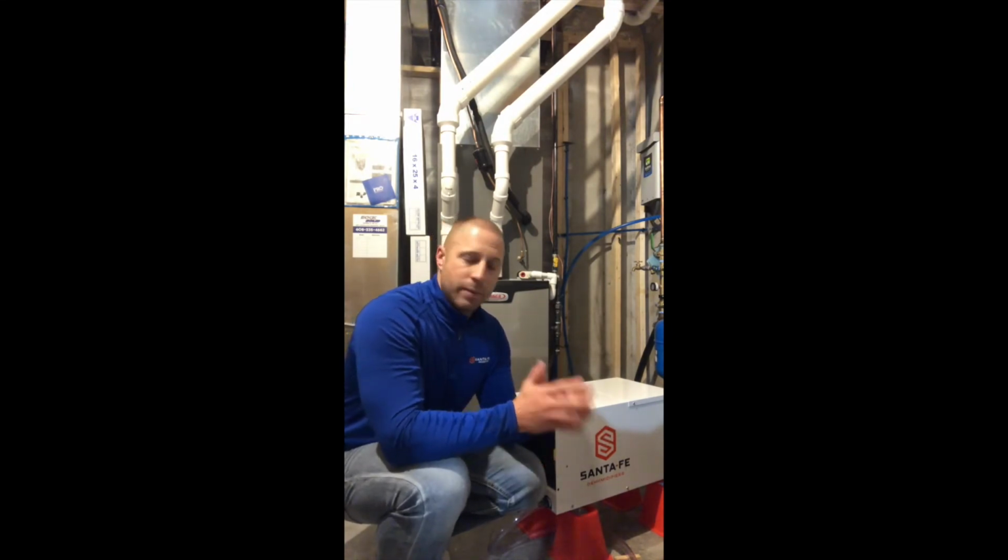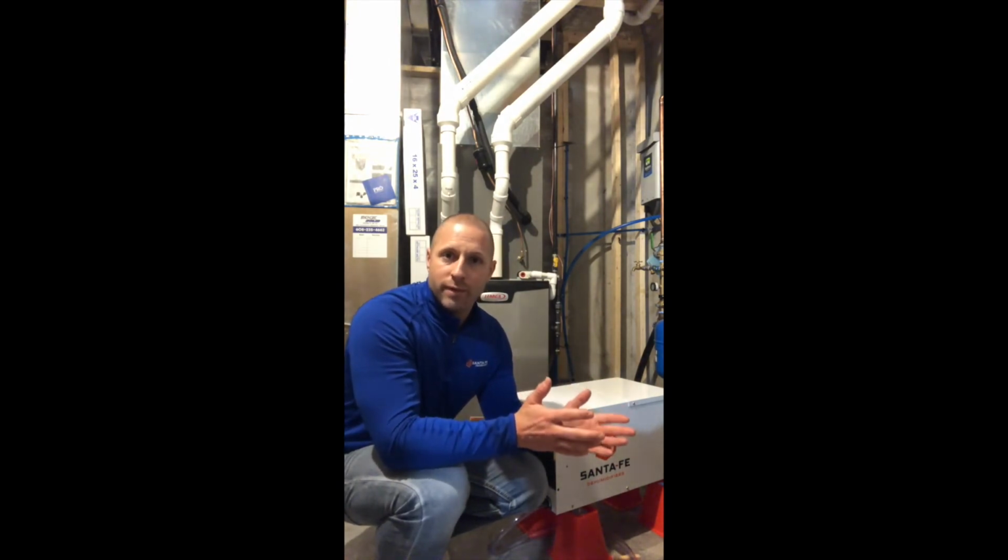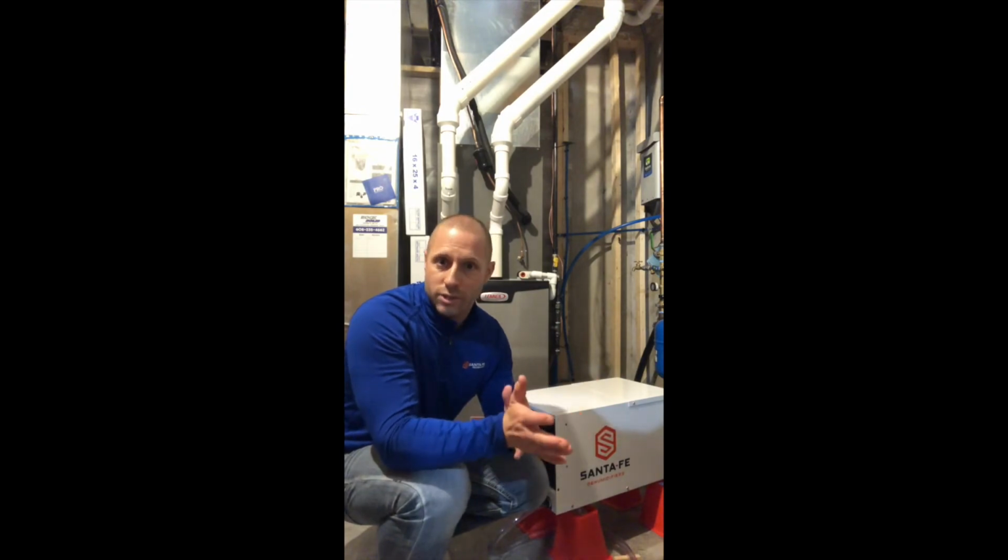So typically when you're tying into the HVAC system or you're running your own independent ductwork, you want to have a wall mounted controller. Typically that's going to be a low voltage controller where you're using basic thermostat wire. Just like your thermostat for your HVAC system is on your wall in a central location. Same concept with the dehumidifier anytime you're ducting both return, intake, and supply discharge.